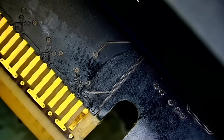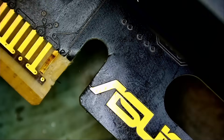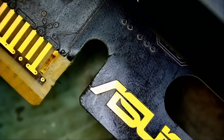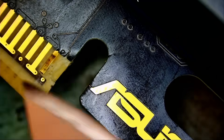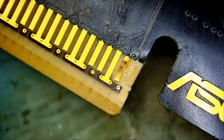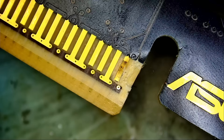This is a multi-layer board — I do not know how many layers, maybe 12 to 14. You have wires running through the layers and I do not know if there's anything running through this piece here. Hopefully not. If you have any information about wires running through this piece of the board, leave it down in the comments. For now, what we are going to do is restore this pad, UV mask the back, and try it. The damage I see is workable as long as the crack is not causing any damage — that's my only concern. If that crack is causing damage, we are going to most likely hear six beeps when we try to power the card on. Let's go ahead and restore that trace.